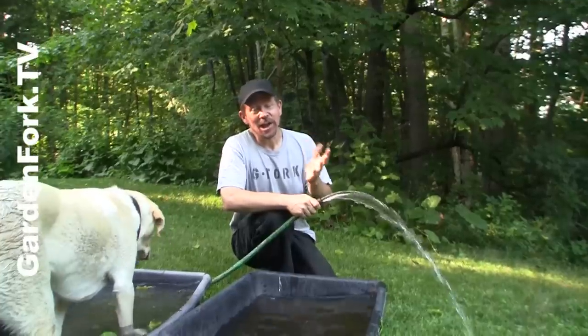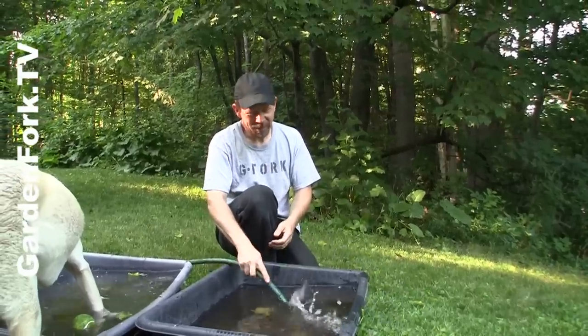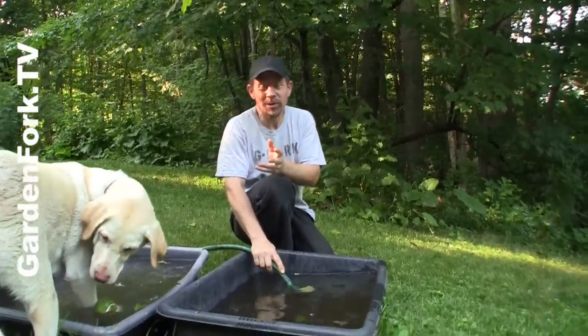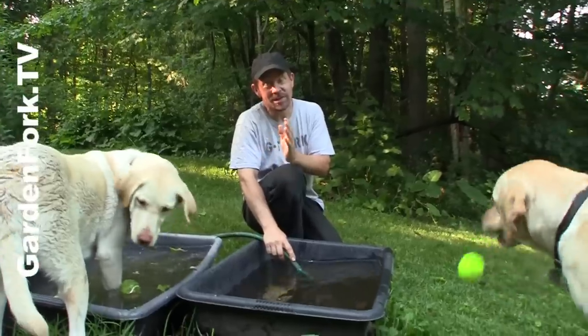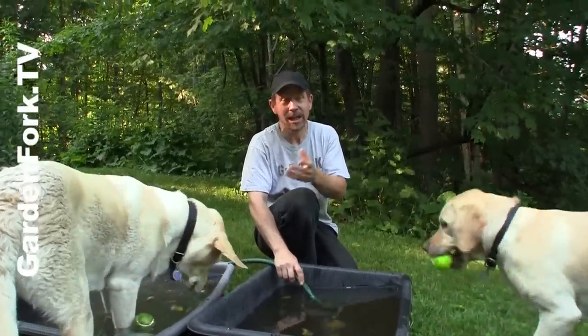So I thought the capacitor was the problem, but it ended up being a much bigger problem, so we had to replace the pump. But when your well pump or electric motor goes out, check the capacitor first — it's the most inexpensive thing. Just replace it, they're about 10 to 15 bucks. Sometimes the store where you bought the pump sells spare parts like that, or their website will, or you can get it from electronic suppliers.